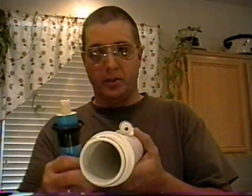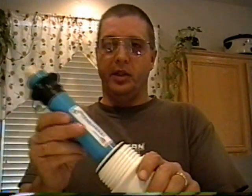Do not go in the other way — they go in this way. If you look at the bottom of the membrane housing, you will see at the very bottom the seat that this O-ring end slides into. It's very important that the O-rings are all the way into the membrane housing, because that's a proper installation. Now, all you do is slide it in. You can use silicone lubricant, or if you don't have any, you can use KY — it's just a water-based lubricant — just as long as you do not use Vaseline. Any water-based lubricant will work. I lubricate the O-rings here and also the underside of the rubber brine seal to make installation easier.